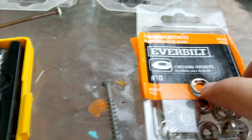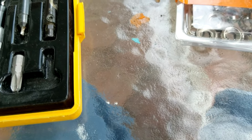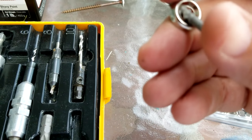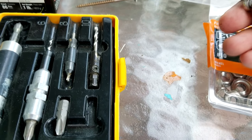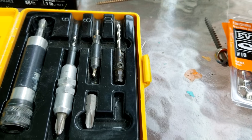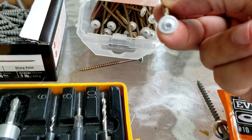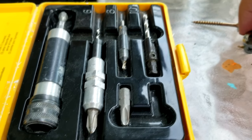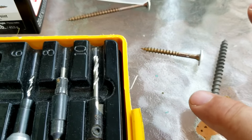Another fastener type that I don't think is appropriate anymore are finishing washers. These are little washers that some installers use — they take their screw and run it through the washer before screwing it into the back of the cabinet. It looks a little tacky, and why would you go through all this nonsense when you've already got the right screw right here? This already has a nice flat head built onto it, and using washers just leaves an imprint ring in the wood.